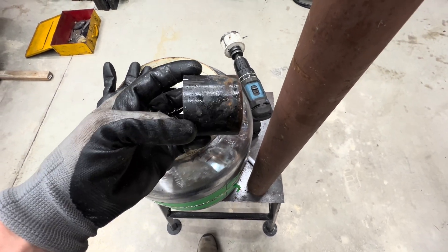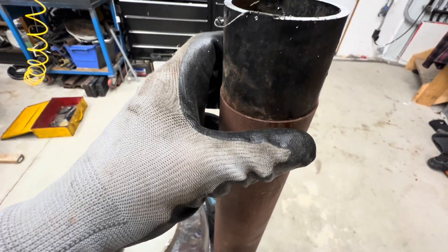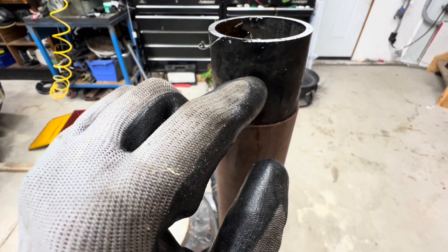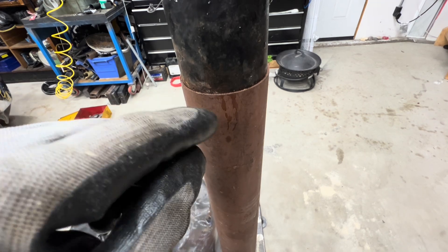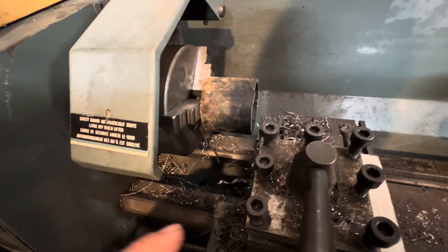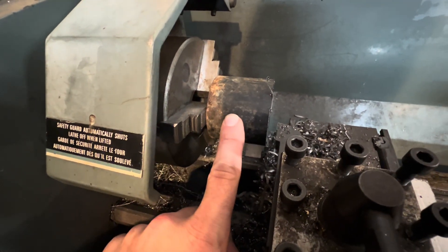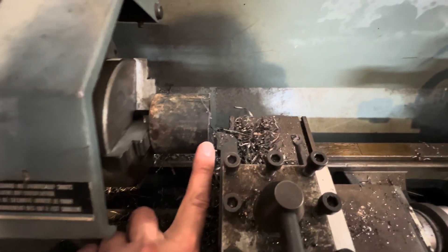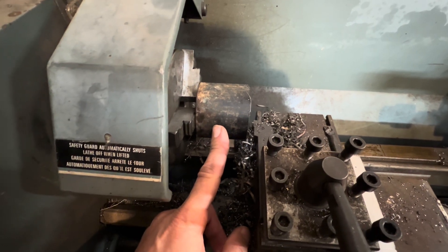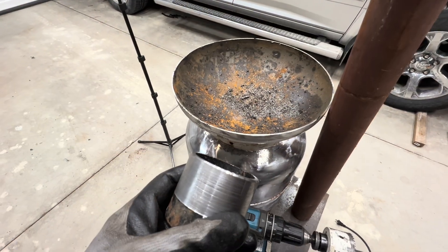This is that piece I just cut in the bandsaw — it's just a two-inch long piece of this two-inch pipe. It fits kind of snug. It's really just a matter of cleaning it up. As I machine it down, I'll take it partway to create a lip so that when it's sitting inside the combustion chamber, it'll sit down onto that lip and won't go any further. I have that piece of tube mounted in the chuck of the lathe in the shed — that's where my lathe is stored, there's just not enough room in the garage. I'm going to square off this end and turn it down to about there. I brought a sample piece of the other tube that needs to fit over it just for testing. I have returned from the frigid shed successfully — turned it down and did a nice little bevel on that edge.